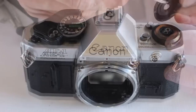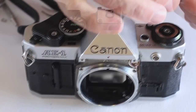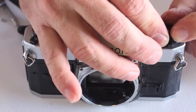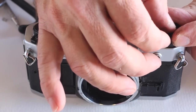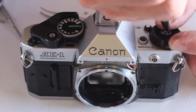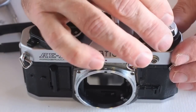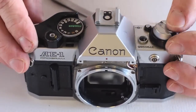The ASA post and ASA dial need to be aligned as well. After seating the ASA dial spring, make sure the ASA dial cover seats into the notches — a slight rocking of the cover will generally achieve this. The ASA dial cover will need to be held in place as the snap ring is reinstalled. There is nothing noteworthy in the remainder of the reassembly steps.